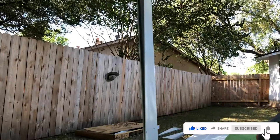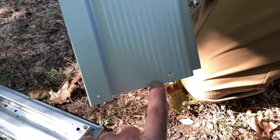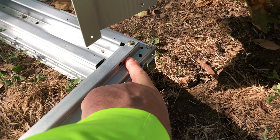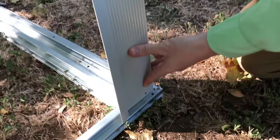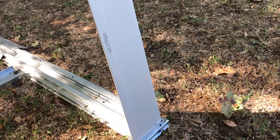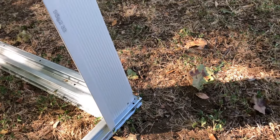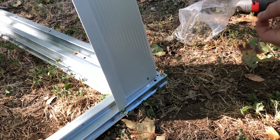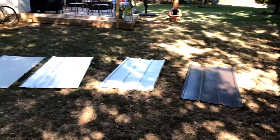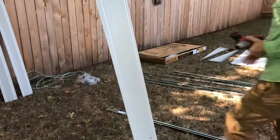What we're doing right now is getting the first front corner piece in place. You go through this hole and match it up with the little tiny hole — there's only one small hole there and that's going to hold it in place. I'll hold it and Nathan will go ahead and screw it in. He's getting a screw with a plastic washer. It's definitely useful to have two people, just like the instructions say. Have that plastic washer for weather protection. After that, we'll get the other four corners in place and then move on to attaching the panels.